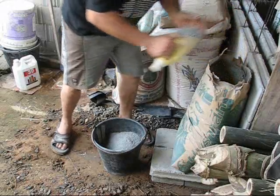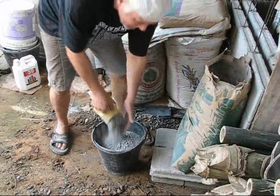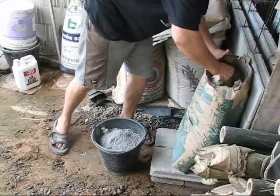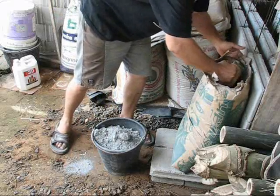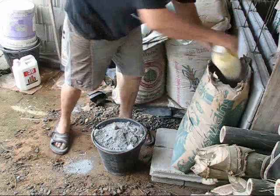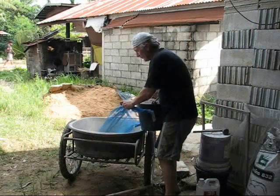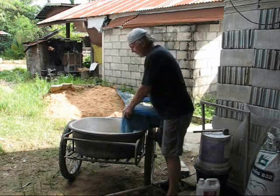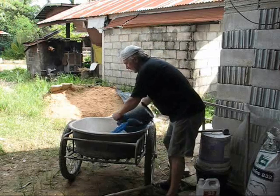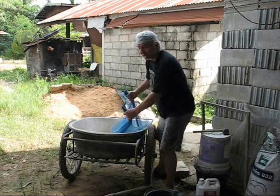And I mentioned that I bought this cement last year. Well, cement gets lumpy. It starts to bond with itself if it sits around too long. So these little lumps will take more than just a soft suggestion to get them to break up. Same cleaning process for the cement, which I wouldn't have to do if the cement was fresh. But since it's so old, I need to turn all the lumps into powder. This stuff is really not good for you.